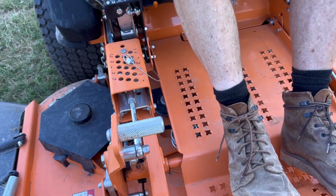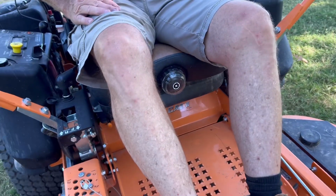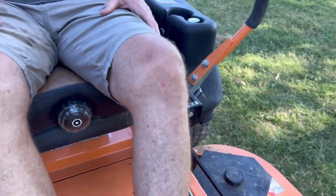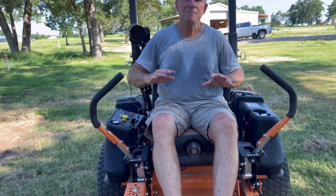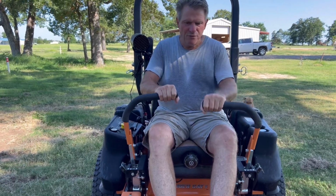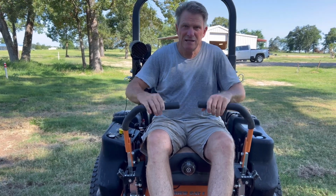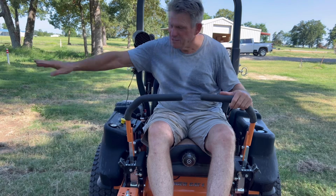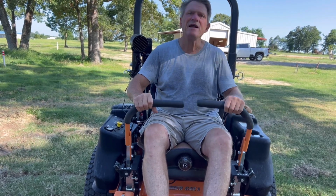So if I want to stop cutting, I just pull the handle to the side like that. Yeah, if you're done cutting, you've been out there driving forward, making turns, cutting grass. PTO's engaged, the blades are turning, grass is coming out here. You're doing your business out in the yard. Now you want to stop. Just bring these to the neutral position, and the mower's going to stop.